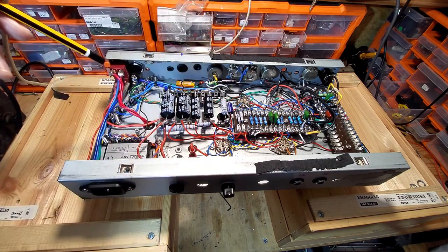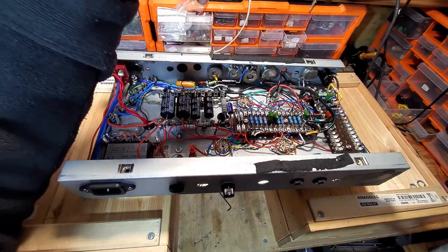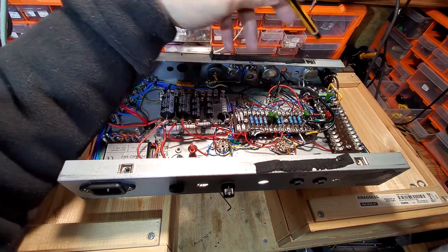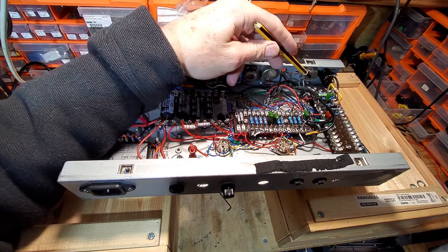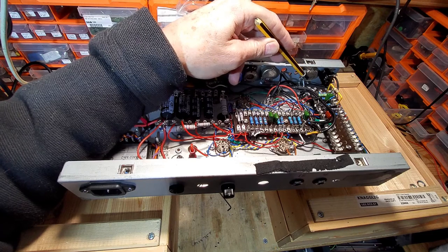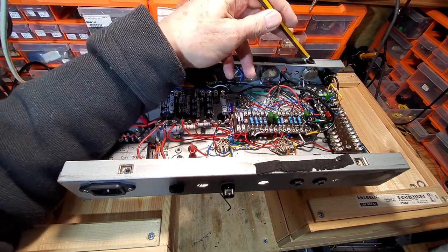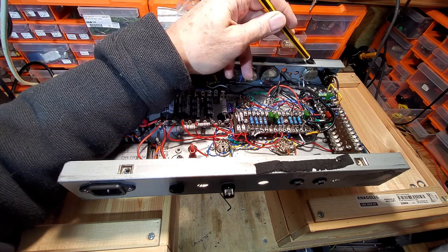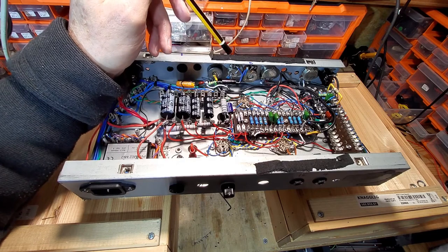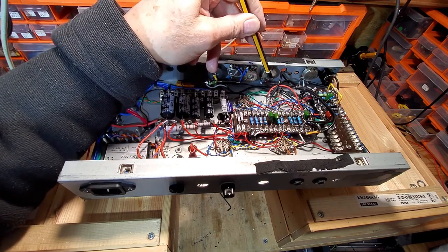So that's taken care of the output stage, got the heaters running. So the preamp stage, and we've got volume and master volume, and let me tell you, getting those balanced was not easy with these valves. So the volume I put between the pentode of the PCF80 and the triode, and for some reason, you would turn it down and it just wouldn't shut down completely. There was a signal leaking through. Tried everything, couldn't shake that off. So I've ended up moving that now, and it's a bit awkward really, but basically now that is just before the tone stack. Master volume is just before the phase inverter, so we've got that in there.